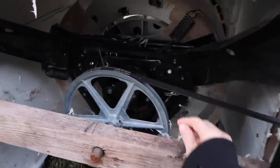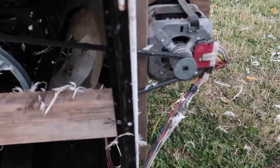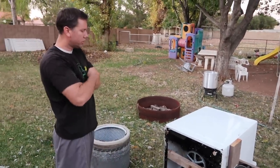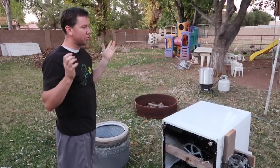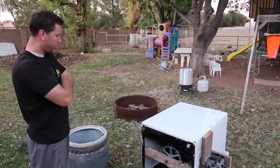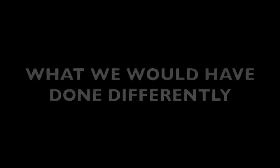When I modified this, I had to buy a pulley and a belt, then move the motor off of the gearbox and unbolt it. The first build with the gearbox took about 10 hours, then the gearbox broke, so I had to rebuild the whole thing with the motor on the outside — another 10 hours. So basically two pluckers built. The plucker fingers inside are about 50 bucks — we'll link to them in the video.